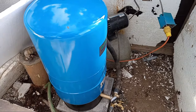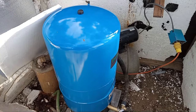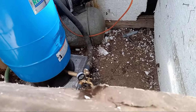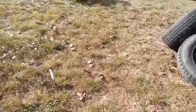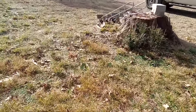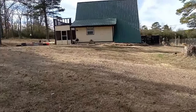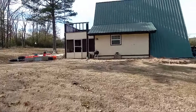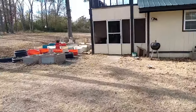I was beating my head against the wall because I made sure there was 28 pounds in here, but I'd go in, run the faucet, and it would build up to 40. Down here we're saying 28 pounds, so I just let some out. The problem is the lines in the house froze last night because I couldn't leave them on a drip — there was no water. But if I come out here to the outdoor spigot, we got water.